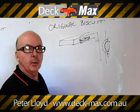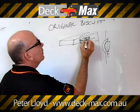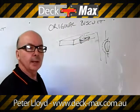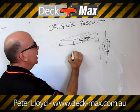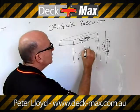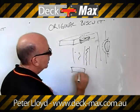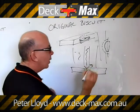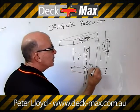Remember, the purpose of this is to get away from surface-fix nails and screws. This secret fixing has a flat cut in the board, and the question often comes up: will it hold water? No. Actually, the driest part of decking is this gap here — it's the driest part, because the airflow up through the gap dries the side of the board faster than water sitting on the top.